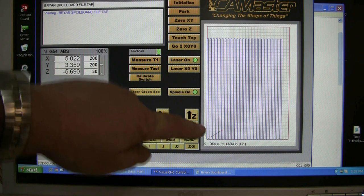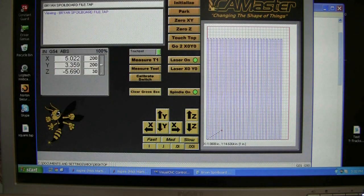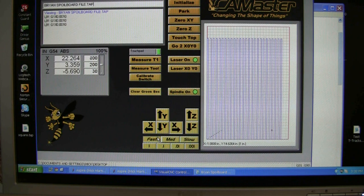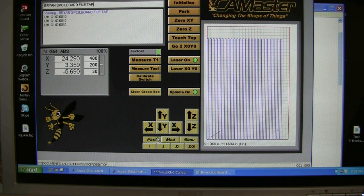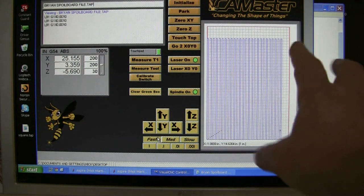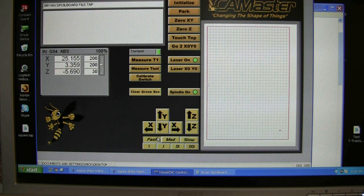In the preview you can see it goes up, down, up, down — back and forth passes across the board. I move my gantry across, looking at my table to see how far it's going to go. I put my router bit on the edge of my spoiler board, and basically I keep making code — copy paste, copy paste — until it looks right. That's what will cut my spoiler board.